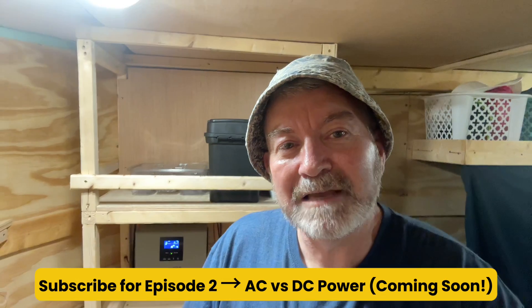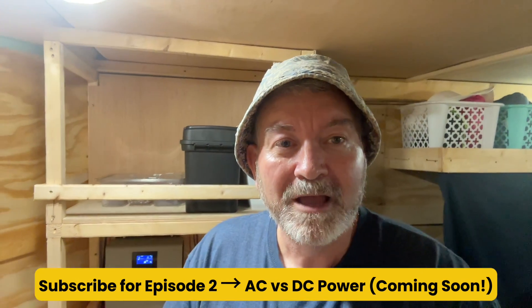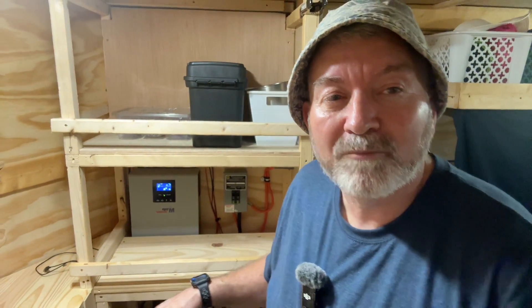Let's bring it home. Volts times amps equals watts. Watts times hours equals watt hours. And you can use this to size your batteries, your inverters, and your solar panels. Always start with your actual usage. If this helped you, tap that like button and make sure you're subscribed, because this is just the beginning. In the next episode, we'll talk about AC versus DC power, what it means, how it affects your setup, and why folks mess up without realizing it. If you want to dig deeper, ask questions, or hang out with other folks learning this stuff, join my free Porch community at askpawpaw.com/porch. And if you're interested in this Red Odo battery or any of their other products, you'll find my affiliate link and a discount code down in the description below — it helps support the channel and keeps me making videos like this for you. Until next time, I'm Kevin, and I'll see y'all on the porch.